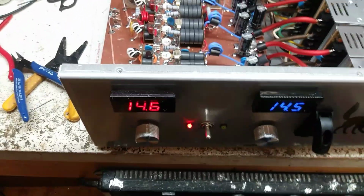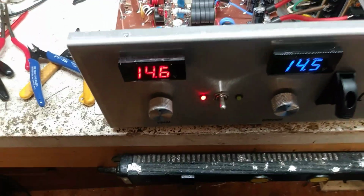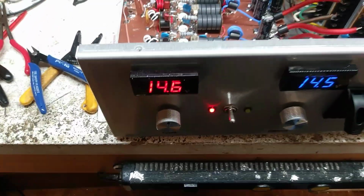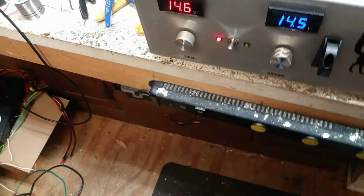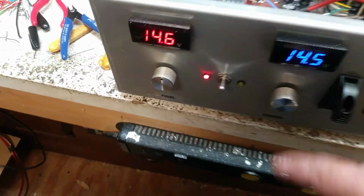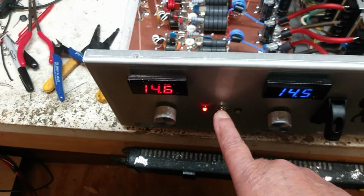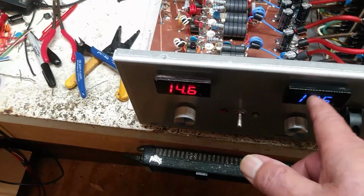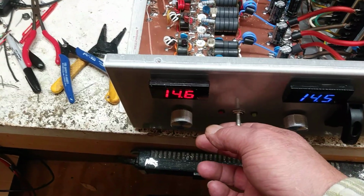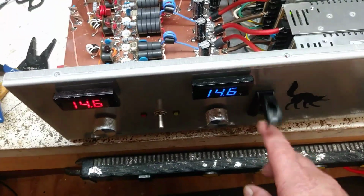You are not allowed to turn this higher than 14 and a half volts. Okay? 14 and a half. All right? So that's all you need. Do not go play with knobs. About 12 o'clock is 14 and a half. Don't bump it. You go to flip the switch, you make sure you check the volts before you even key it down. All right. So I got your toggle guard on here. Shut this puppy down.